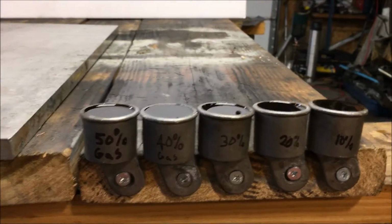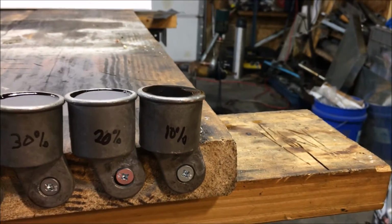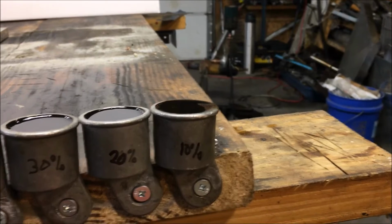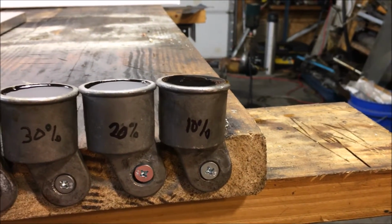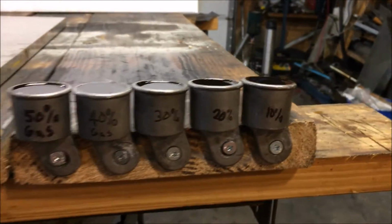Now, if your device has design limitations, you may be required to run a 10% mix. A lot of waste oil burners have nozzles that are set up for viscosities in the diesel fuel range. So if you go putting a thick fluid in there, they're not going to atomize properly, especially if it doesn't have a preheater on the system.